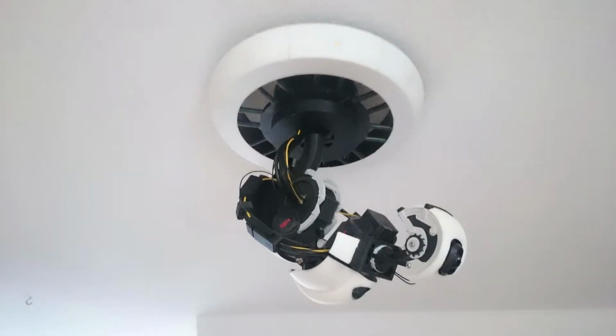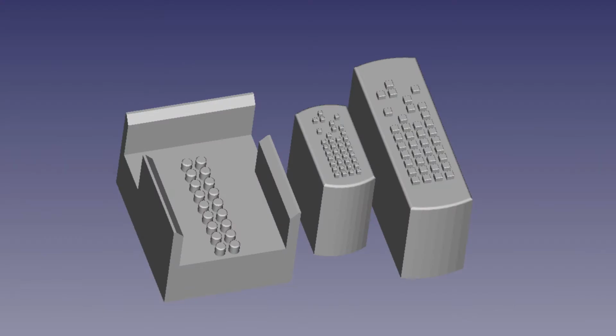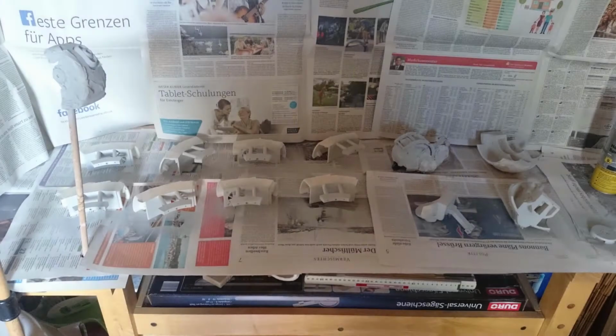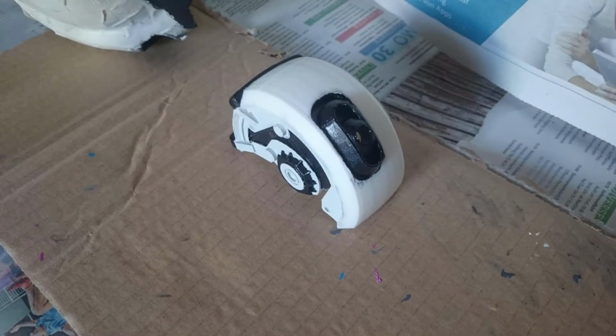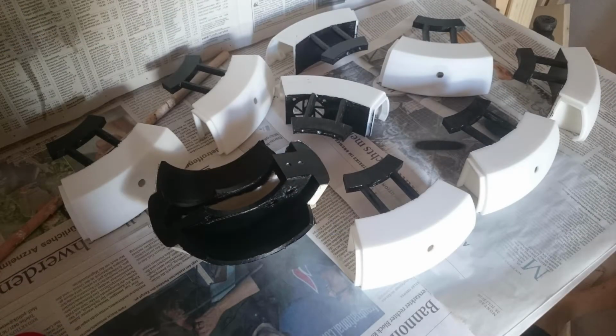Some parts also required painting, as they contained multiple colors and small features, like the small red dots on some body parts. For this, some additional stamps were designed and printed to help with applying the small features. The parts were first primed and, after letting them dry, painted in the right color. This process took roughly 24 hours, mainly just to let the paint dry.